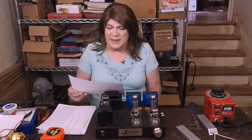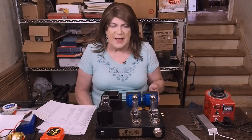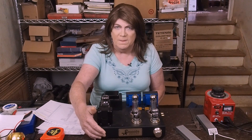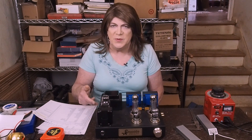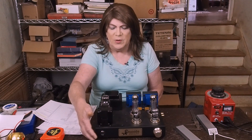The first one I'm going to build is going to be identical to the one I'm currently using - that's my own. The only differences are moving the RCA jacks to the back in a more traditional place, moving the speaker jacks over a little bit, and moving the power switch from the front to a simple SPST toggle switch in the back corner to simplify the wiring, save a little money, and open up room in the front for mounting the choke sideways so there's room to put the bottom cover on.